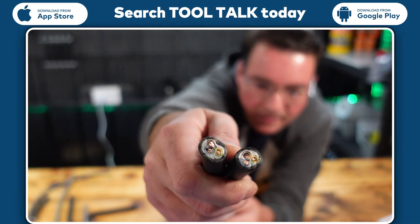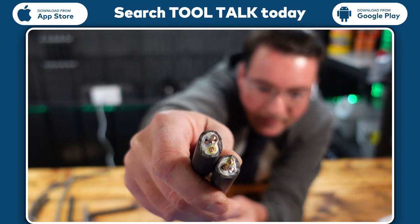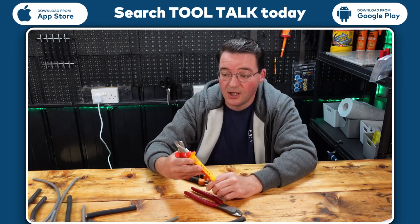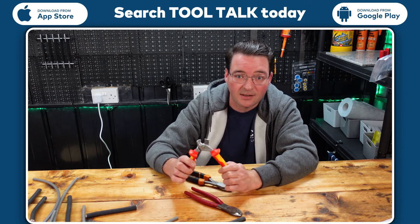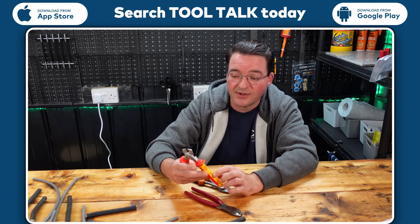You can see the difference — the step cutter cut leaves the cable still quite round, compared to the crushed flat result from the other cutters. They're really sharp. I don't think they'd struggle much even on 25mm cable — I'd just have to open them up wide. They cut very cleanly and don't crush because the idea is they cut one strand at a time.